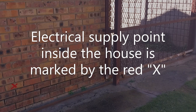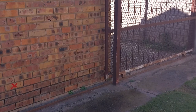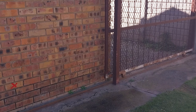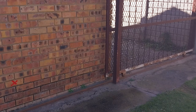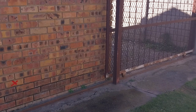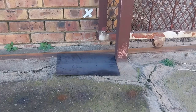The red cross marks the spot where we will be supplying our gate motor with power from an electrical plug point. When fitting the electrical supply cable to the gate motor, we do not want any obstructions — it needs to look neat and tidy. Where the electrical cable is quite far from the gate motor, one would need to open the concrete and bury the new electrical wire in a pipe underneath the ground. X marks the spot where the electrical supply cable hole will be drilled through from the inside of the wall outwards.